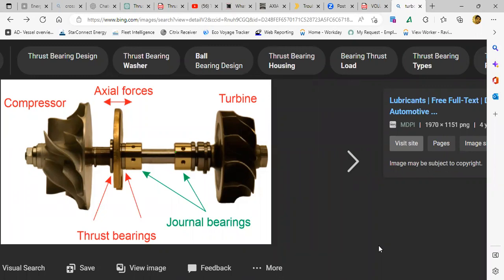How do you say that? Because with the circlip only holding, it will not be fixed. Correct. It will be rotated. If the bearing is rotating with the shaft, right? Yes, sir. There is no relative motion between the bearing and the shaft. So how is the lubrication formed? Because the lube oil film is between the bearing and the shaft, correct? If both are rotating together, there is no relative motion. So how will the hydrodynamic lubrication be formed?